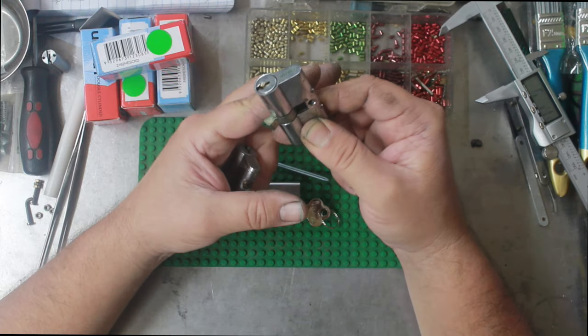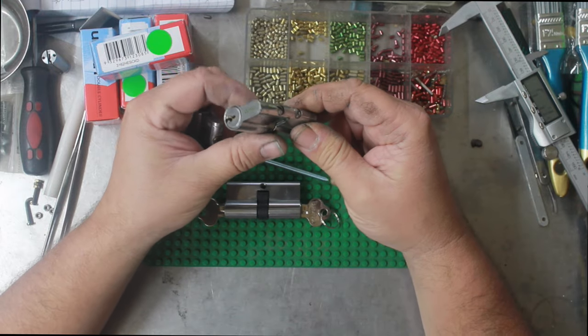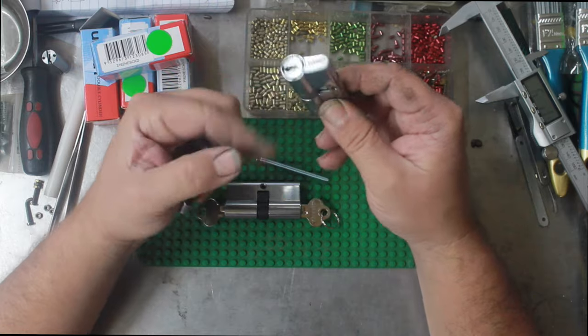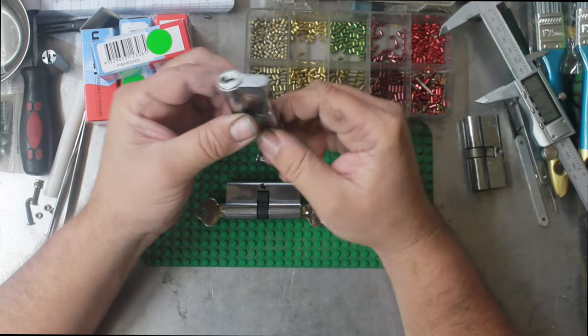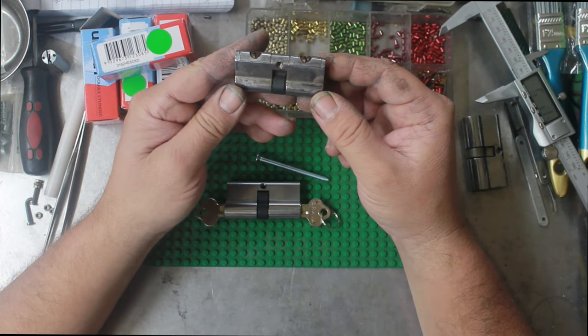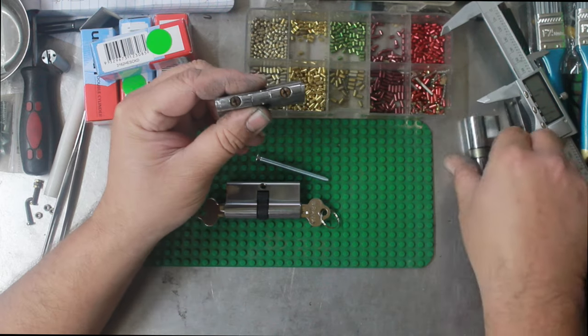Very rarely are they used on mortise locks. It's more of screen doors, which are like your security door, your aluminium type door that goes on the outside of a house. So that's a floating cam, looks the same, but that's designed for screen doors. These ones are designed for mortise locks, European mortise locks, or Euro locks, if you want to call them. These, once again, can be rekeyed by removing the caps. Very similar as this one here.